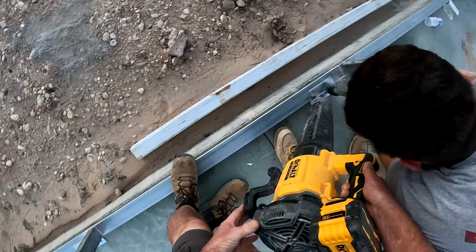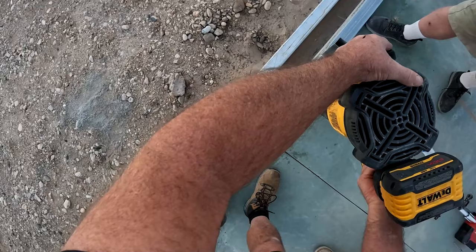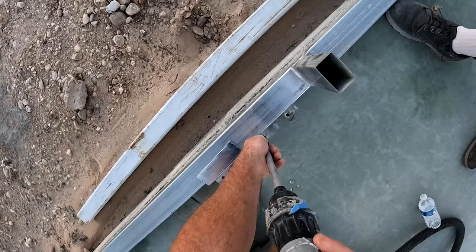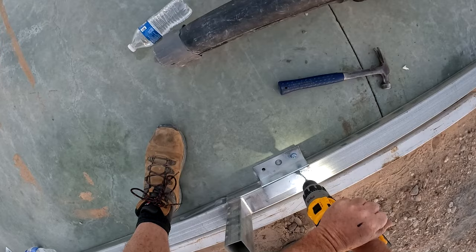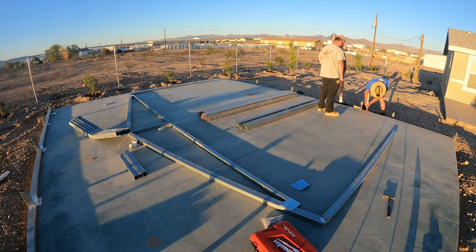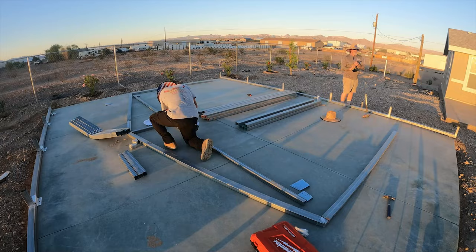These are your perimeter walls and this comes as a kit. These uprights that you see here are for your studs — they're at five foot spacing. It's all one piece with the base. You can see how we're offsetting the anchors that hold this all down. Initially they used to drill right through the plate, but it was too close to the edge for an expansion bolt and it would often break the concrete. So they came up with these things called Z-clips. Now your hold downs are inside a bit — much stronger setup to hold down the building.